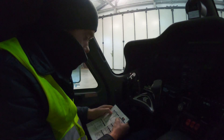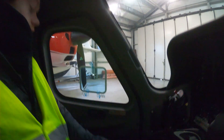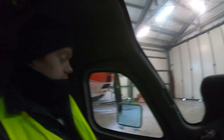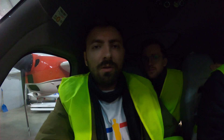Doors are closed. To open and close the door it's release, then pull towards you — make sure you give it a solid pull. There's also an indication on the door; it's an oil pressure based sensor, so when the engine is running it will flick up to identify the door is secured. That's basically to stop you from opening the door in flight because of the propeller. When you have passengers in the back, I recommend going outside and checking manually from outside that the door is locked.